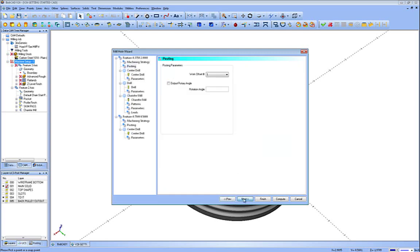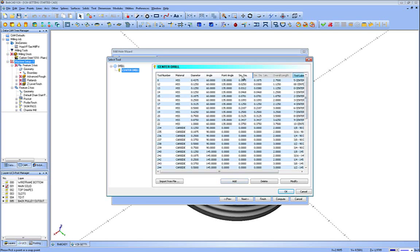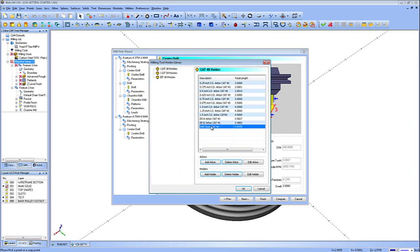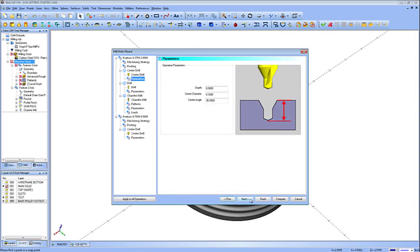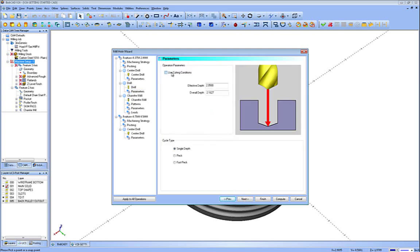Work offset one. Now we're on to the tool — this is the center drill. Go to your tool crib, tool library. I'm going to use a 3/4-inch 90-degree spot drill and assign the drill chuck, making sure it hangs out long enough to cut all the way through. Tool number 6. The depth of my spot I'm going to put at 100 thousandths; you can also define it by diameter and center angle. Now we're on to the drill — this is the 375 drill, make sure the point angle is correct. We'll assign the drill chuck to this one and make sure it hangs out enough. Speeds, feeds, and coolant. The use cutting condition option looks at the cutting conditions for drilling. We're going to peck it with retract and use the auto peck that's there.